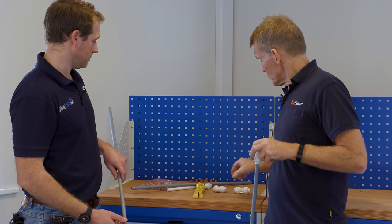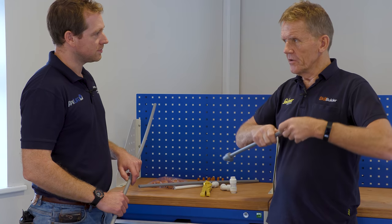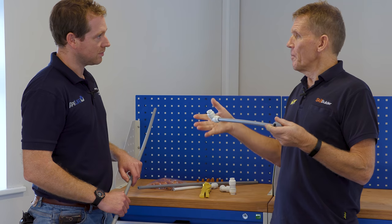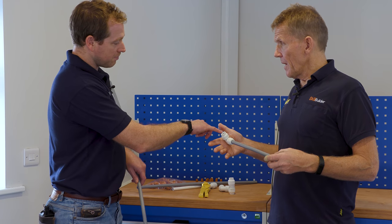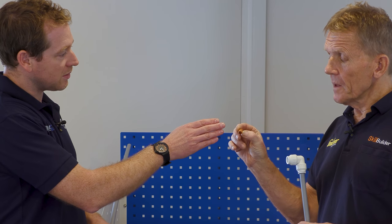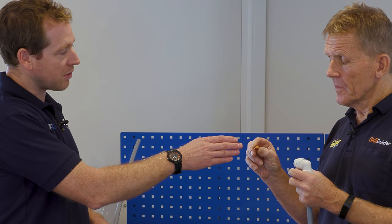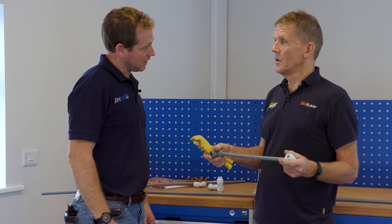In your range of fittings — it's a twist lock fitting — you obviously do a stop end as well. Because if you do nothing else, you use those stop ends. We can connect this up to copper using compression fittings — a British standard compression fitting. You could quite easily put a piece of 15 mil copper into this side of the joint, gone from copper to plastic. Fully suitable for a compression fitting — our inserts are reinforced plastic, so it doesn't matter if it's compression or push fit.